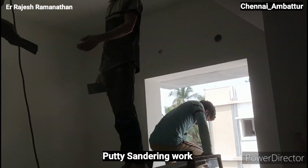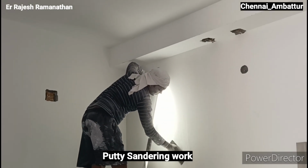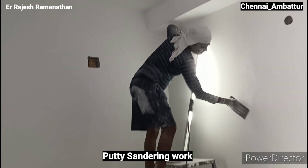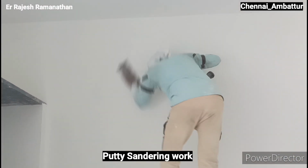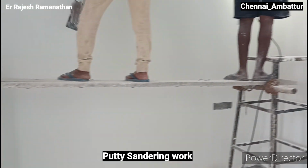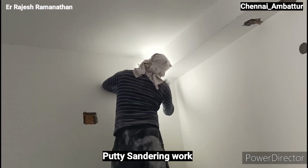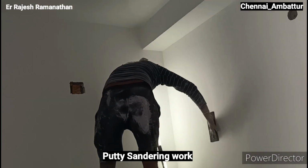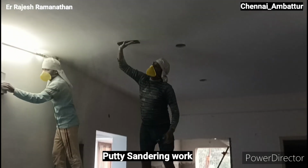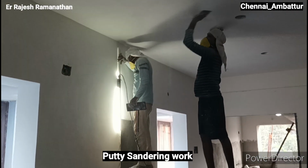When you are opting for a major color change, painting over the existing coat does not give the desired color. The new color keeps mixing with the old color and the resulting shade appears to be a combination of both. This can be avoided by using a wall primer for house painting, as it will bring the wall back to white so that you can start over. This is especially important when you are changing the paint from a dark color to a light color. Primer for painting also provides a new and clean base for dirty walls that are hard to clean.